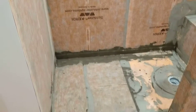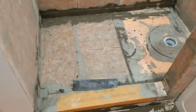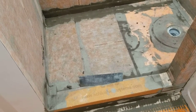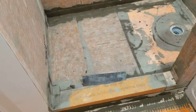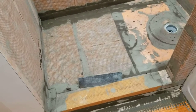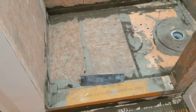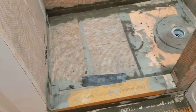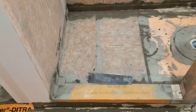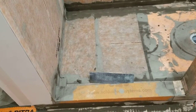The waterproofing membrane goes all the way to the floor, and I put a couple layers of the KERDI membrane on the floor to try to increase the slope a little bit. I laid almost one inch of a concrete base and sloped it towards the drain, because even though we did level the floor, there wasn't enough slope in the preformed pan that came with the KERDI system by Schluter to really make the water drain the way I wanted. So I put two layers of the Schluter DITRA KERDI membrane on the floor just to increase the slope a little bit more.